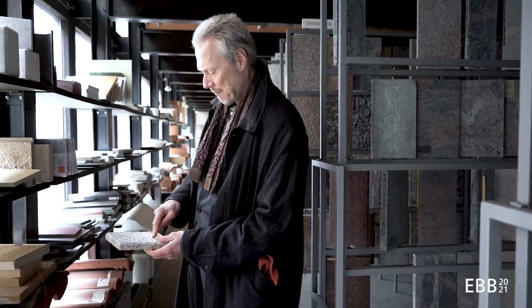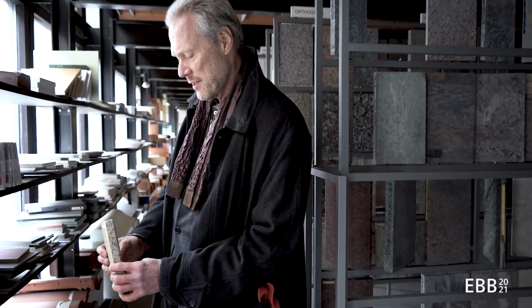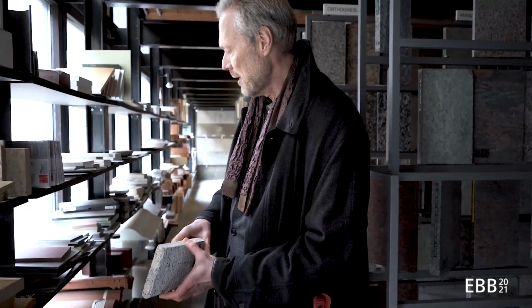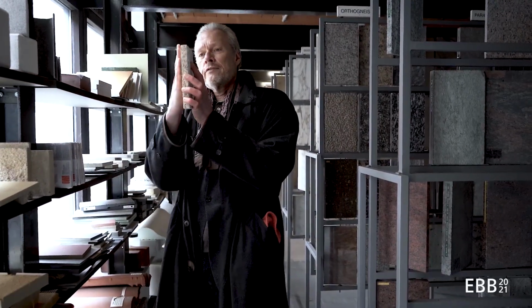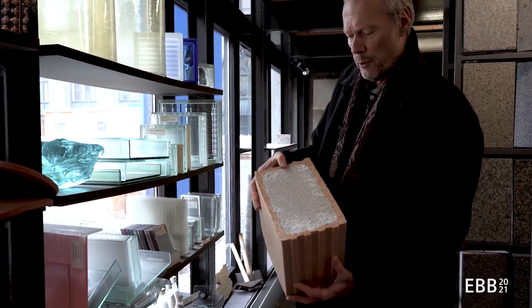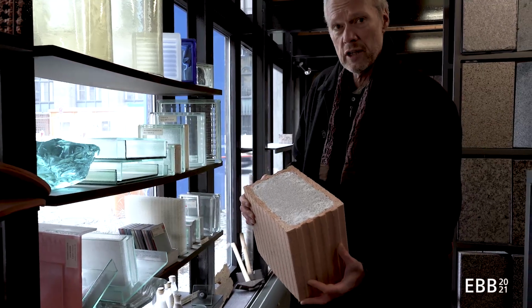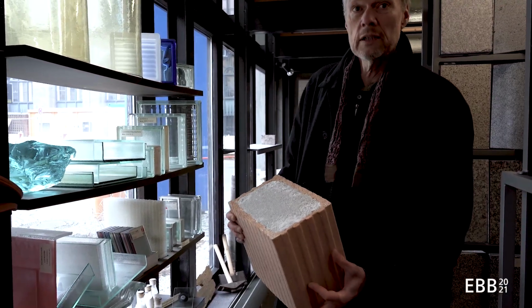It's wooden wool, and it has been petrified with cement to make one of these Heraclit facade panels, which were a long time used to insulate the fronts of floor slabs in a load-bearing facade. This is a modern lightweight brick with a perlite infill, which is also used as an exterior insulation if you don't want to put the stucco directly on the insulation.